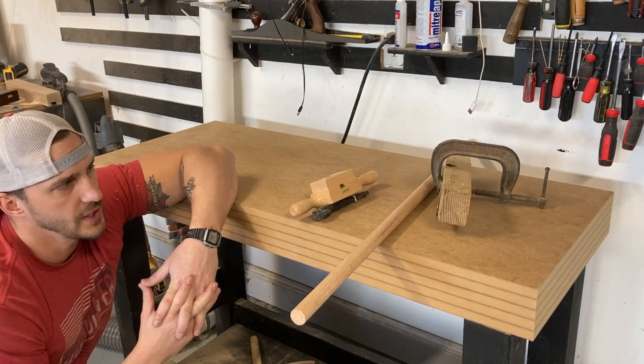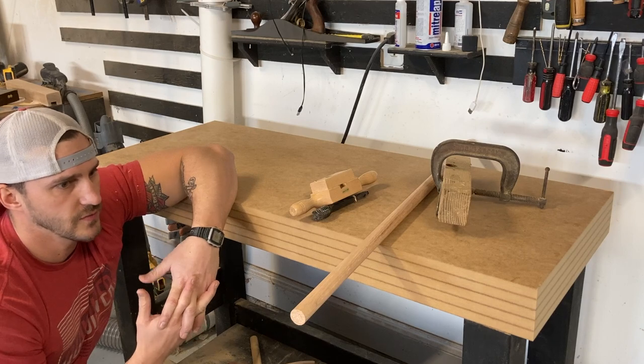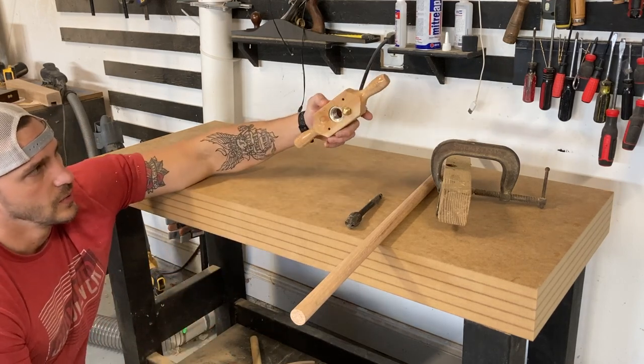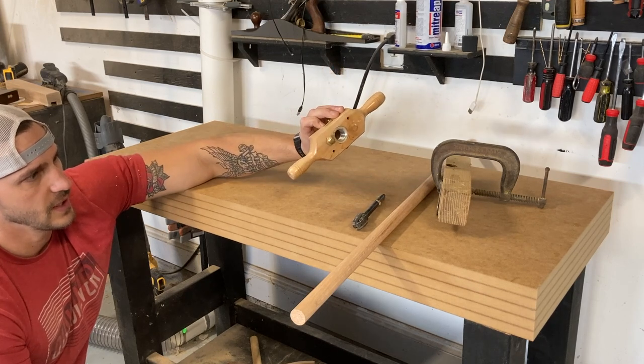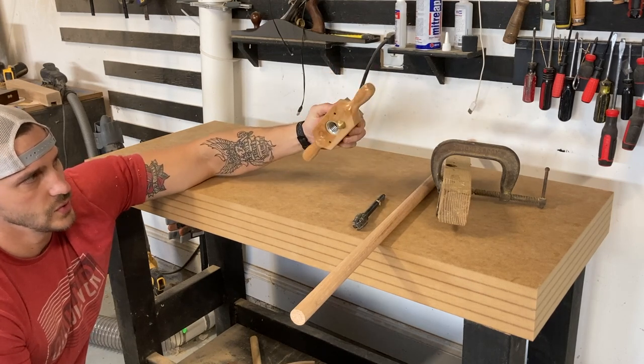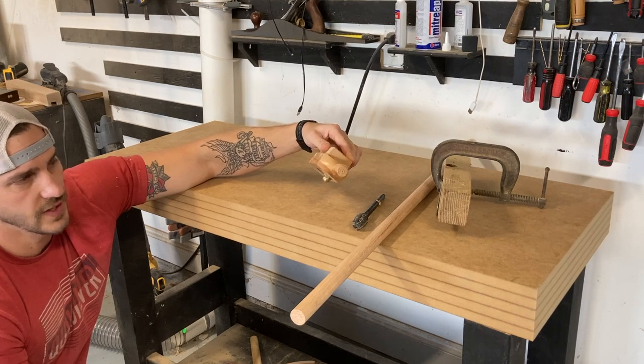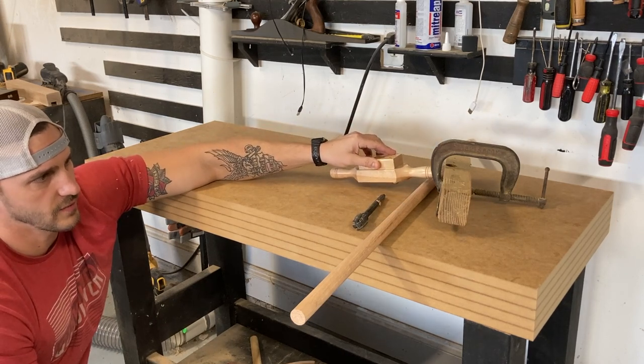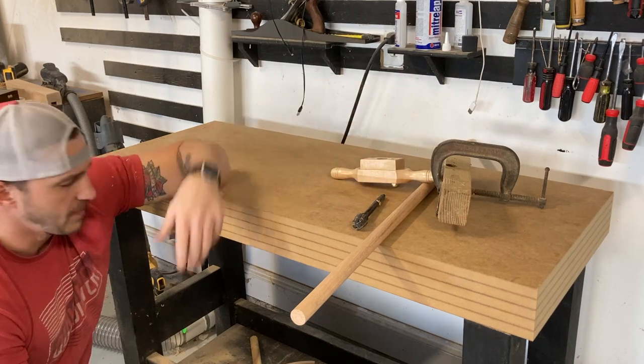And I figured 1-inch has other applications. You can use it for clamps or other jigs. Whereas if you bought one of these 2-inch jigs to make wooden threads and screws, you're really limited to just doing vices. You're not gonna use a 2-inch wooden screw for anything else other than a vise. Whereas a 1-inch, maybe you could.